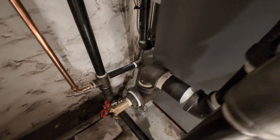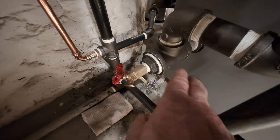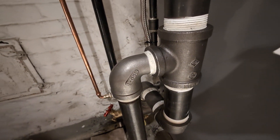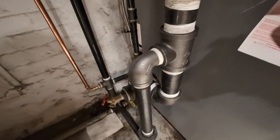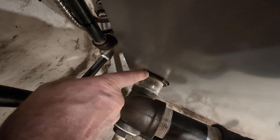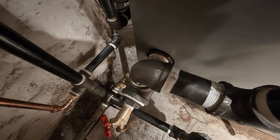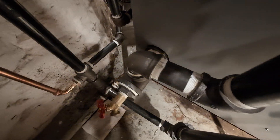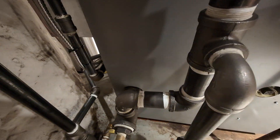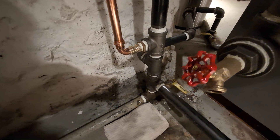This is the return. That's the boiler drain that comes with the unit — we've got it on this side so we can add water and flush across the bottom if necessary. That's our Hartford loop, and I use a stainless steel street 90 there for corrosion resistance, as well as stainless steel where it goes in. Now this outlet is two and a half; I've got it reducing down to two — the instructions call for inch and a half, so I go a little bigger. This swing joint here allows for expansion and contraction of the header.